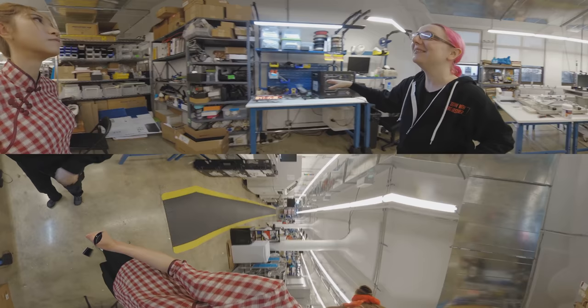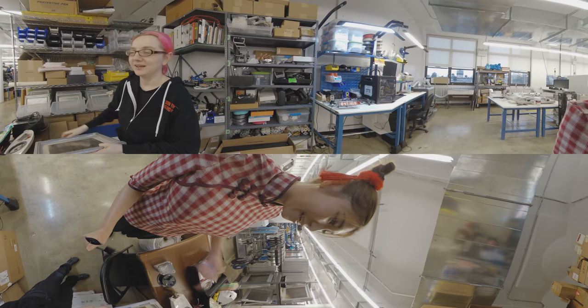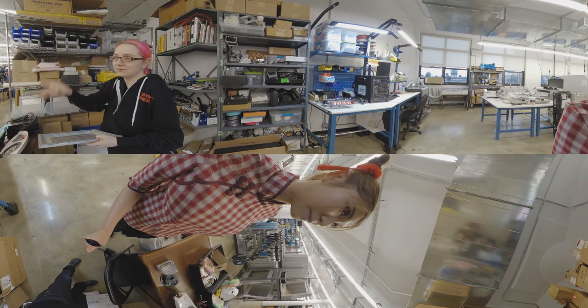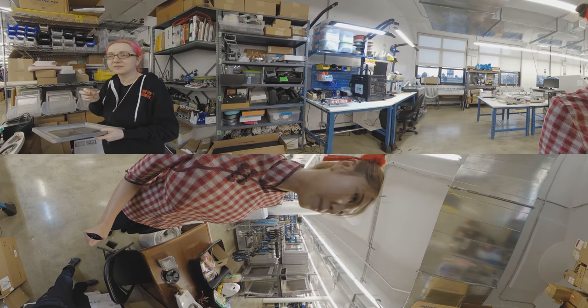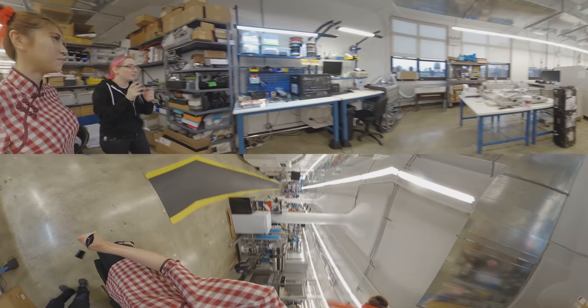This is a prototyping area where we design new things. Actually, this is our old stencil — we used to do stenciling by hand, so these are much smaller. You would actually do it by hand. In China, I saw them do it by hand and it's fine. But we bought a machine and then the price was good, and it's more precise especially when you get very small parts — 0.4 millimeter pitch or BGA. You can do it by hand but we're not that skilled. We're replacing them with toothpicks — I don't know how to do it.